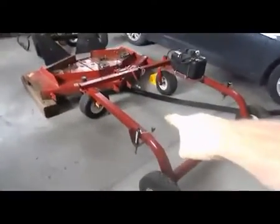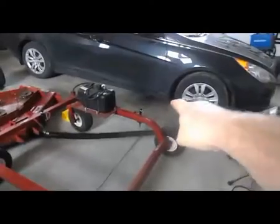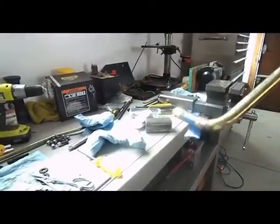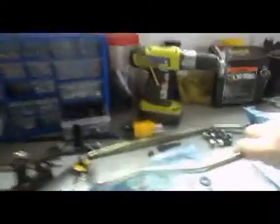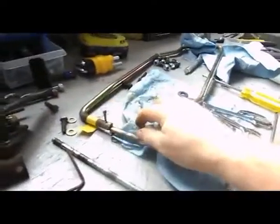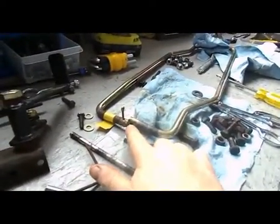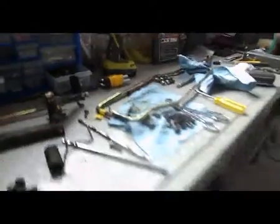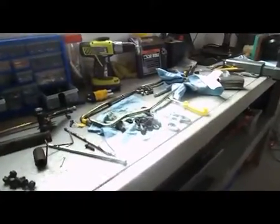There are 3 adjustable screws. There's 2 there and 1 at the front. Now these bars are bent and shaped a certain way, as you can see. So I had taped them the side I took them off, just to remember. But when I got my service manual, I noticed that one hole is drilled to the side and one hole on the other bar is drilled to the top, and that's how you differentiate them, because they're basically shaped the same.